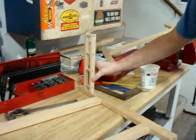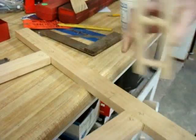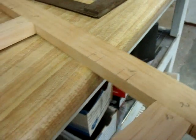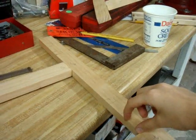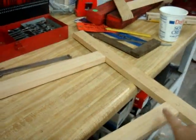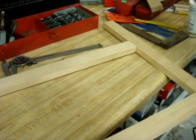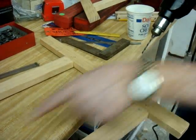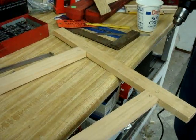The way we're putting these together — this is one side, this is the other side — is we're going to put them together with these plate rails that we bought and cut down. They're going to fit right there and right there, and you can see we've marked for them. Based on my bedding, which is going to be approximately an inch thick, he's putting the rails in. So I'm going to drill pilot holes here where we've marked, then we'll attach the plate rails, and then we'll do the other side.